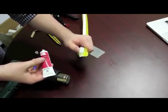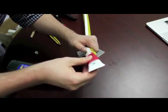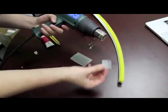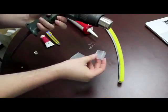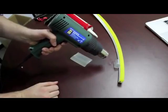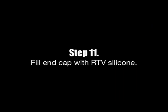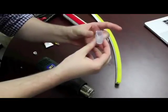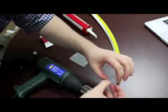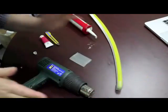On the termination end of the LED neon flex, apply the oxidation guard to the wire ends. Like the cap on the power cord, the end cap is not going to quite fit on, so it needs to be softened with the heat gun. Once it's flexible enough, you can fit it on to cool, and just let it cool like that.